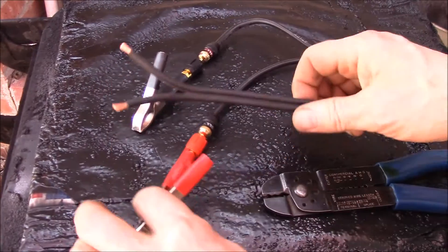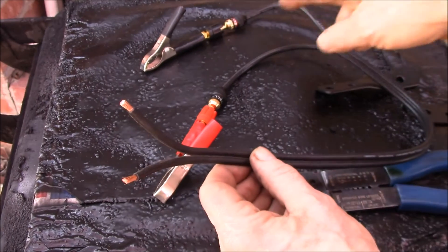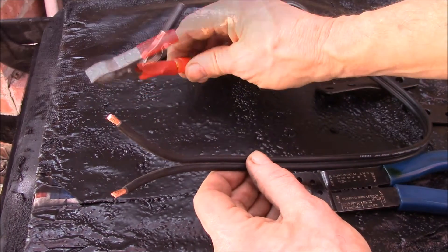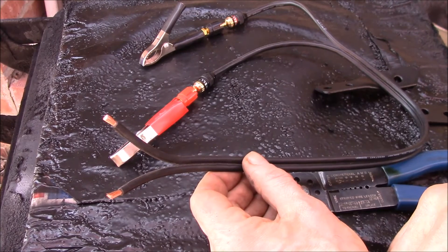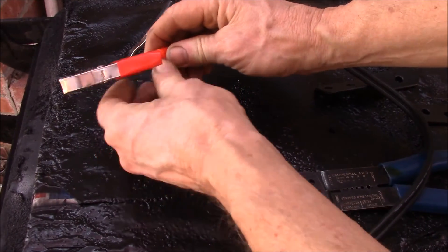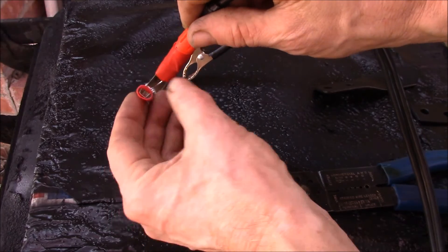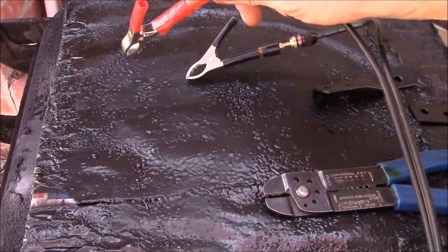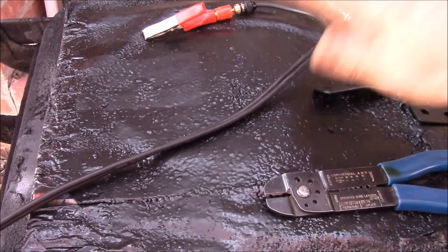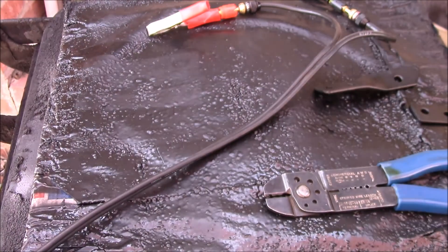This will let me discharge the 12-volt lead acid batteries, or act as an extension cable for the power cable. I just have to figure out the polarity. I'll show you this cable when I get the XT60 soldered on. Hopefully this will handle five or ten amps — a lot better current handling than the original setup that just had the banana plug going into that crimped piece of metal.